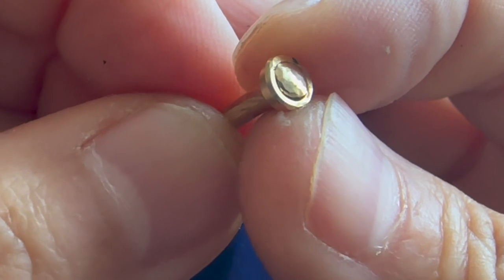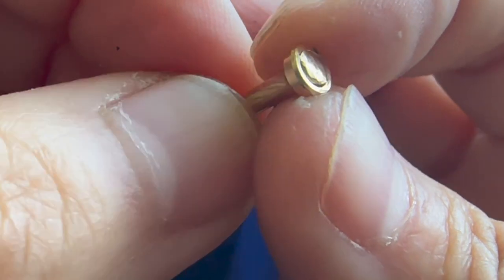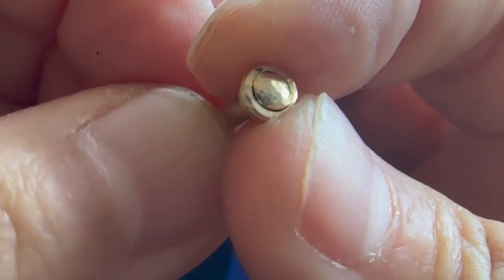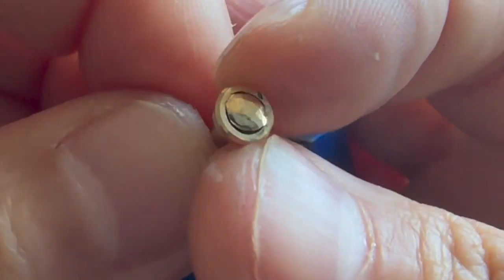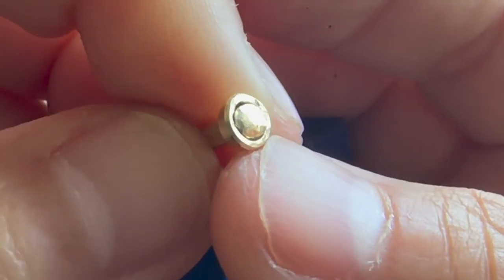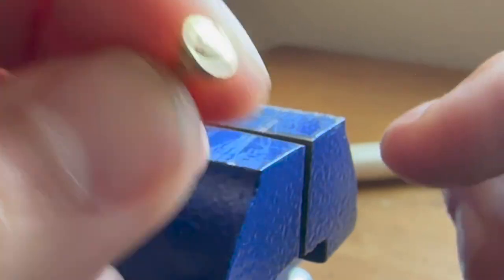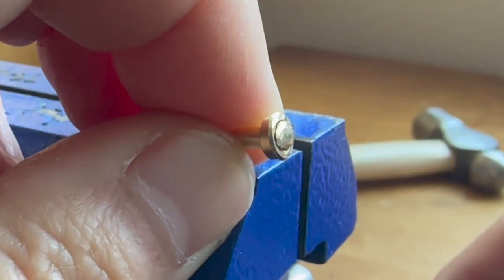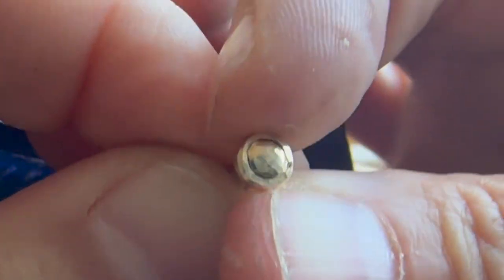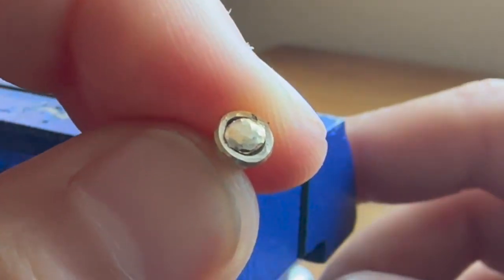My apologies for rushing the peening in the first place and making a video where you'd imagine I would take the time to do it right as a presentation, but the tendency is to rush a little bit, and that's what I had done. At least that happens to be my tendency. If I had taken the time to peen the end closer to the desired outcome, then when I stacked all of the tool parts and then had to peen the other side, I would have put myself in a better position for an easier and more successful outcome. So it's not perfect, but then this could be tapped on a little more to flush it around the perimeter a bit better.